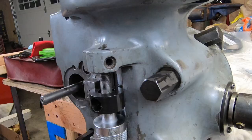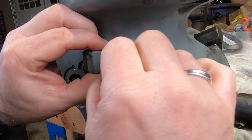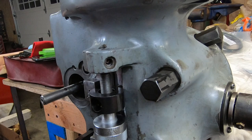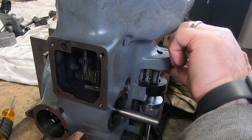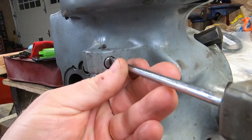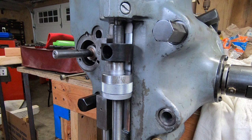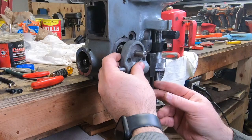With that in place you can kind of see a little bit of how that lever operates between the plunger and the screw. There are some companions to that trip lever: at the top this plunger, and there is this reverse trip ball lever that goes in after that and then is covered with this cap. These are part of the stop mechanisms for the power feed. This bevel gear and this bracket with the handle on it are part of the feed reverse and feed trip mechanism.